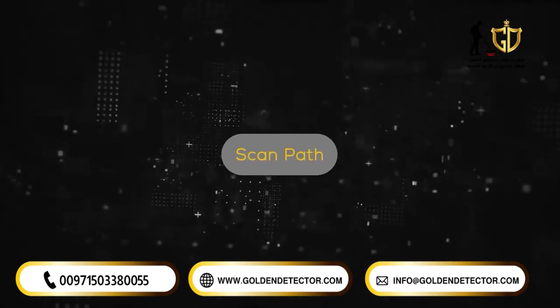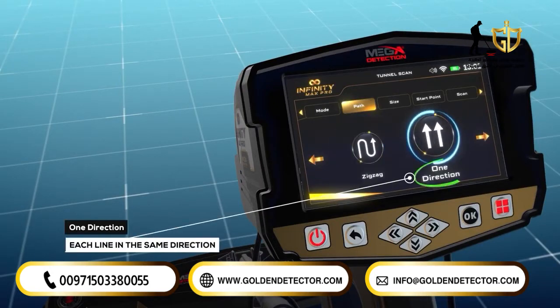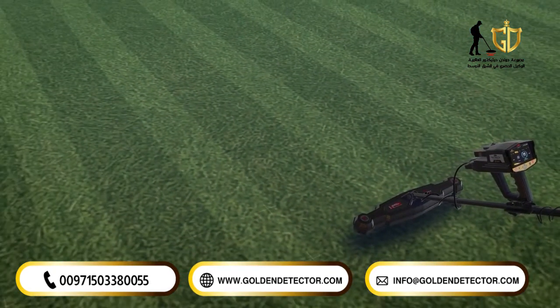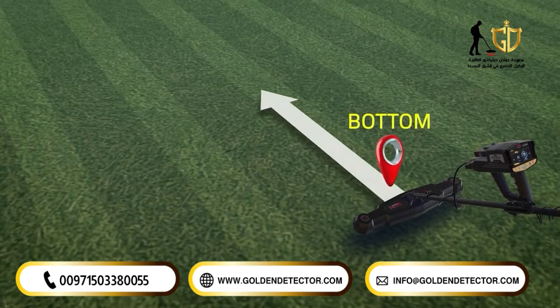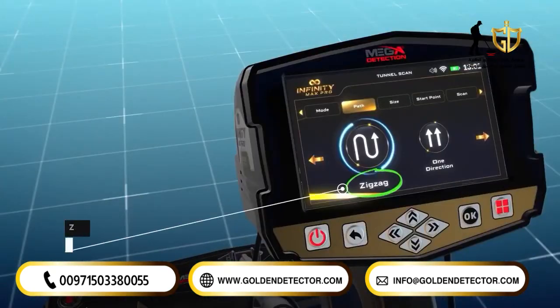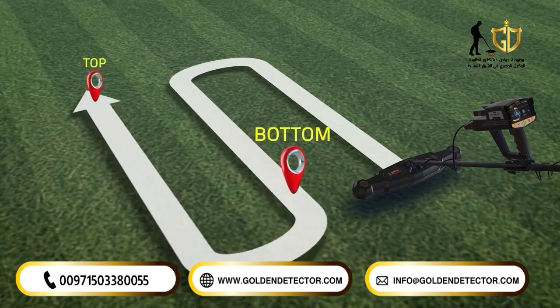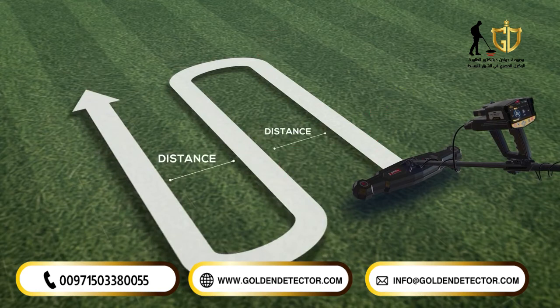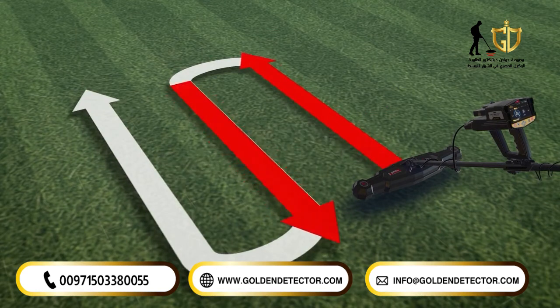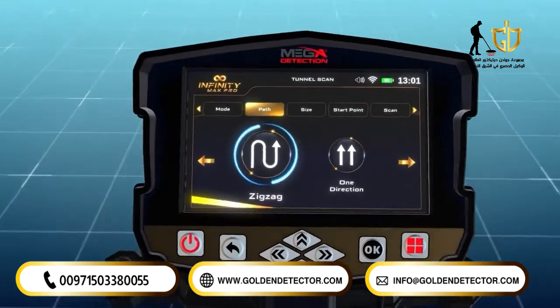Scan path. On this screen, the user can specify the direction of the scanning path, which includes two options. 1. One direction. The ground scan is performed for each line with the same direction, i.e., the direction of the scan is according to parallel lines and a distance between them. 2. Zigzag. In this case, the start of the next scan line is at the end of the previous scan line, while leaving an offset distance, meaning that every two successive lines are scanned in an opposite direction. Select your preferred scan path mode using the left-right arrow buttons, then press the OK button.